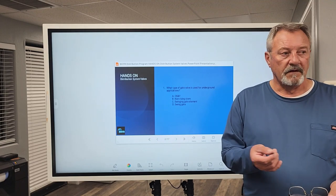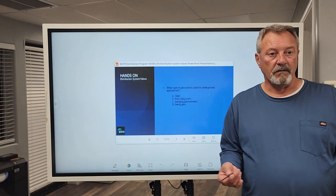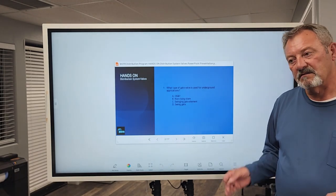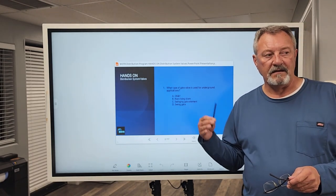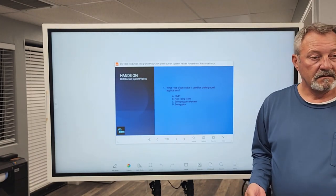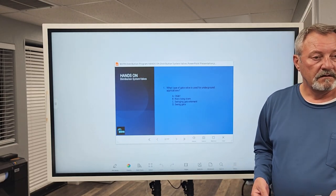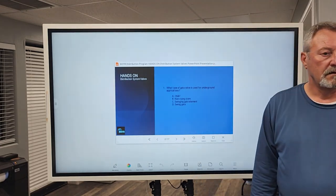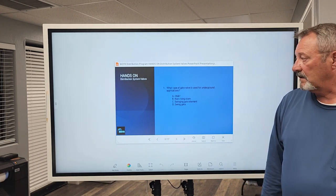And let's see, most of us here in this room live in this system. So we want to see the pressure up at 60, 70 PSI. Now 70 PSI is about the limit, because once you start getting to 90, 100, 110, your water using appliances and fixtures, it can shorten their service life. It can wear them out faster because they're having to deal with more pressure than they're really designed for. They can take it for a while, a couple years, 3 years, 4 years, but after a while, it gets old really quick. It wears them down.